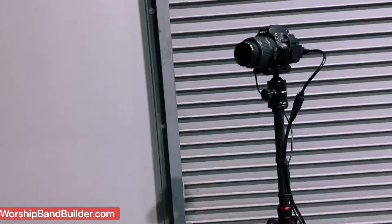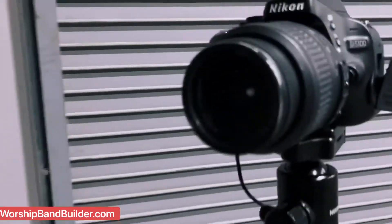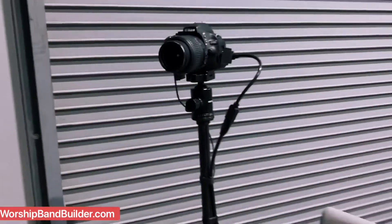We could run this up to 100-200 feet, and then you would have as many cameras as you want. Although it's technically not running through your network, you're making a network to run it through — so you're not going through your Wi-Fi, not through your router or anything. You're going straight in hardwire, HDMI straight from your camera all the way up here to your soundboard, and when you get there you just redo the connection and you've got your cameras coming into your switcher.